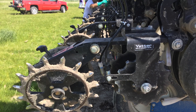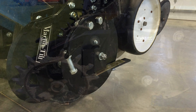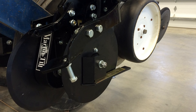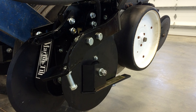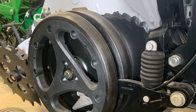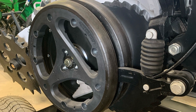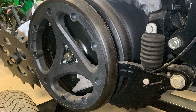Over the years we've tested 2x2x2 we've looked at three different systems, two of which were PFR proven prior to this year. The first is the Yetter Dual 2968 system, which mounts up between the gauge wheels and closing wheels toward the rear of the row unit. We've also looked at the Martintill Dual UMO, a 2x2x2 system that mounts on the front of the row unit right where row cleaners would be. And then we've looked at the Precision Planting Conceal system, where we put knives on both sides of the row — delivering nitrogen on both sides, right at the same point where the seed goes into the ground, staying consistently three inches away from the row unit at all times. All three systems are now PFR proven — Conceal was added to the list this year, while Martintill and Yetter were already on it.